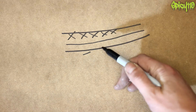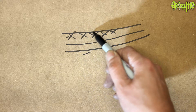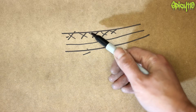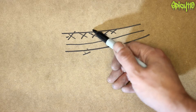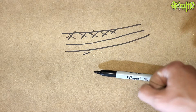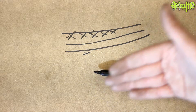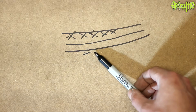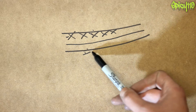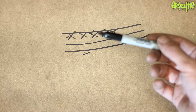What they used to do was cover the top edge of the blade with clay, so when they heat the blade you get a differential in how hot each bit gets — the thinner unprotected edge gets much hotter than the clay-covered spine. Then they quench it in water or oil. There's a great video of someone quenching a samurai sword — it's basically straight, and as it goes into the water you watch the blade curve up, then relax back down. That's how they get the curve into the samurai sword, caused by the hardening process and the differential between the spine and the front edge. By having soft pliable metal at the rear and hard metal at the front, you get a hard cutting edge but a flexible sword.